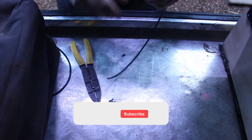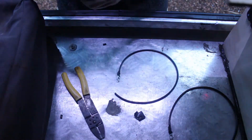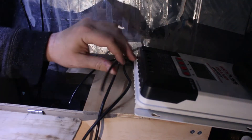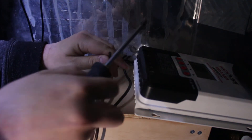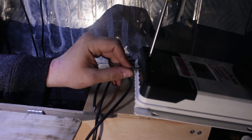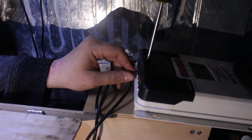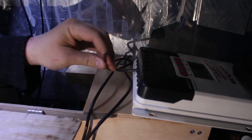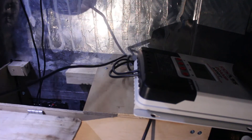I'm going to try and finish this before it gets completely dark. Basically when you do this, you want to connect your battery load up first. I'm going to connect the positive first and tighten these down. These ones are really good - first of all they use a Phillips head, which I like instead of modern ones using flat heads which are always annoying. And they've got massive spots where you can put real thick cable in. Now this should turn on - yep, it did.